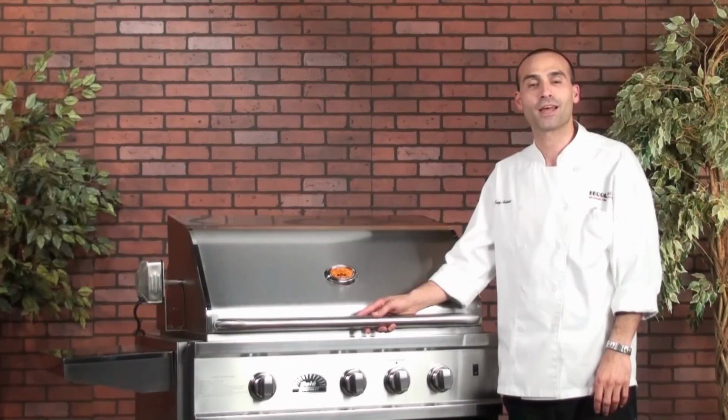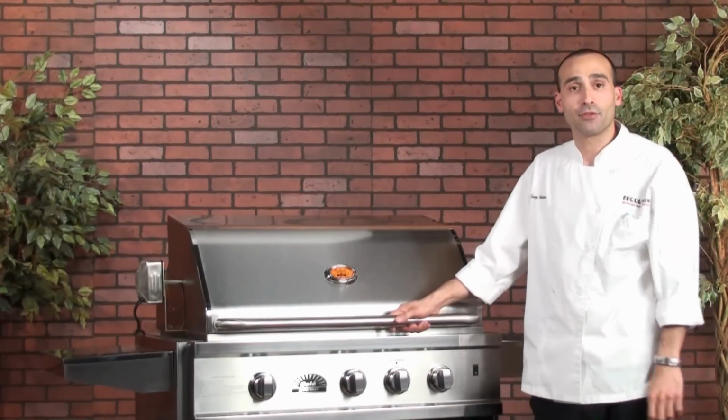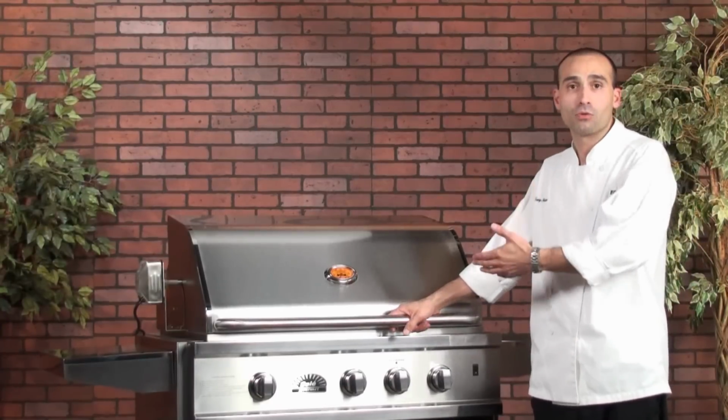And the last tidbit I'd like to share about 443 is that for years I thought there was no such thing as quality stainless steel that was also magnetic. 443 happens to be just that metal that I always thought didn't exist. 443 is magnetic, and the reason for that is, as I stated earlier, they have no nickel in the alloy blend, and nickel is the ingredient in the stainless steel that inhibits its magnetism or magnetic properties.